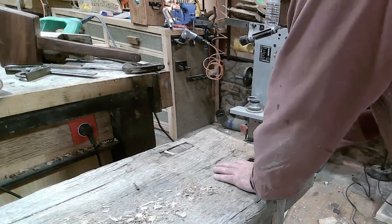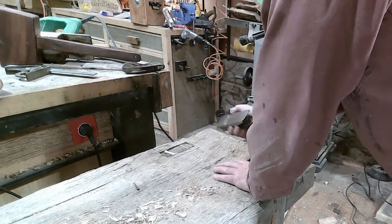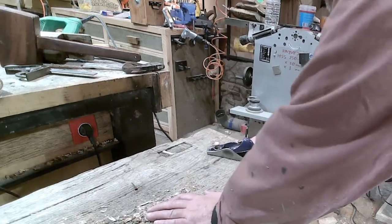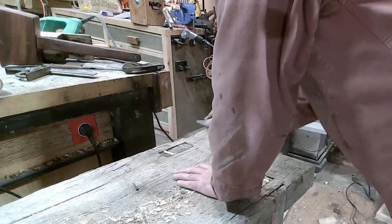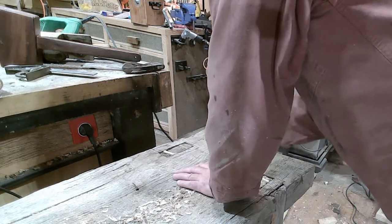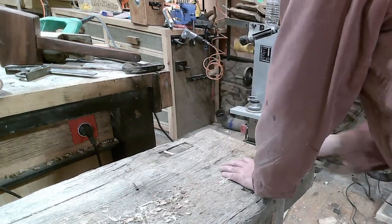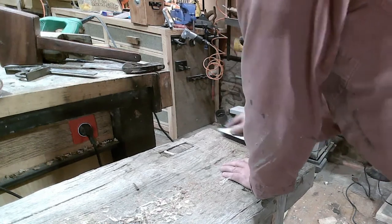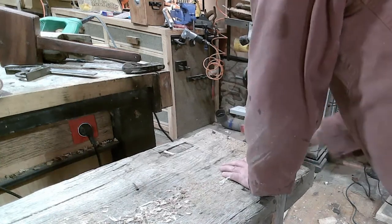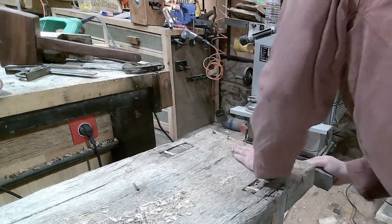I'm not going to take that arris off, because it's against the wall. Can you imagine working on this when it's rocky like that? I haven't made it any narrower. When it's in situ, I'll put a little bracket or cleat behind, underneath, to the wall, because then it'll be rigid. The thing is, where it was, it's just going to deteriorate anyway, so at least this gives it a little bit more life, I suppose.